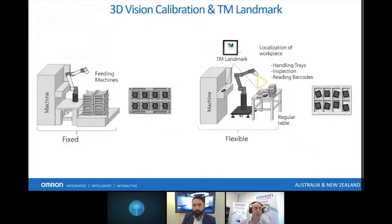This next slide shows the vision and landmark benefits. On the left, a cobot without a camera must be fixed in the same spot, and if parts move 10 or 20mm the robot will miss them. On the right, with the built-in camera and landmark feature, the operator can wheel it in, position it roughly, load the parts on the table, and as long as the parts are within the field of view the robot will pick and place them all day into the machine. Much more flexible by having the camera and the landmark.